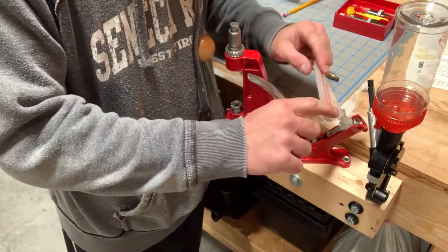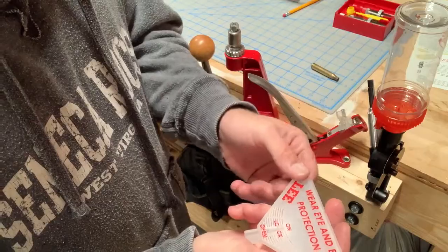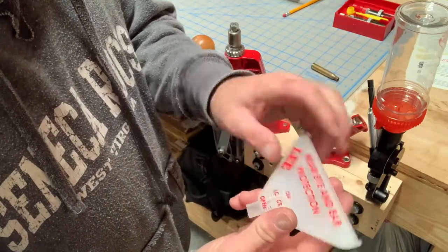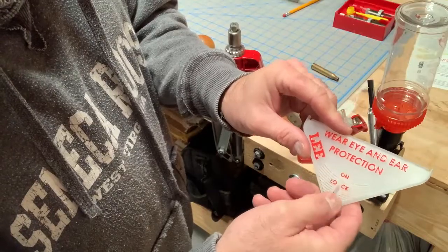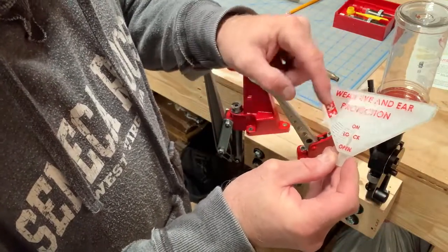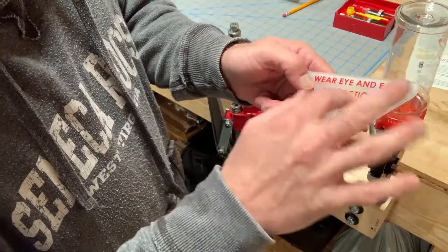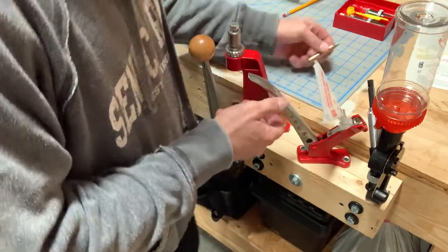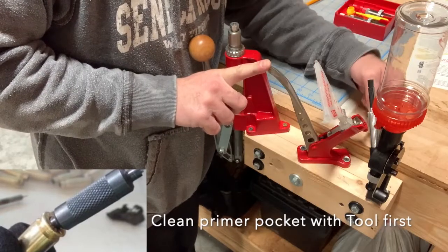This little piece up here is where you simply put your primers in. It's really simple — you just open this lid up, pour your primers in there, and before you close the lid you can just tap it and they'll all orient themselves in the proper orientation. You close the lid and you see where it's got 'lock' or 'open.' If you put it in open, the flap comes up; if you put it in lock, it just holds it shut. When you turn it on, it's got a diamond-shaped wedge that allows the primers to seat down into the bottom feed ramp. When you put it into the open position, it allows the primers to land into the feed area. Put it in your priming tool, click it in the open spot, and pull your handle all the way up — that'll allow a primer to slide into the feeding mechanism.